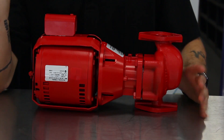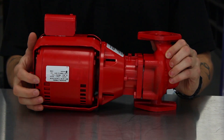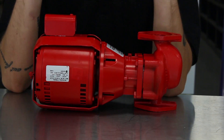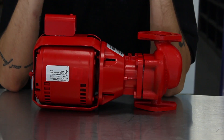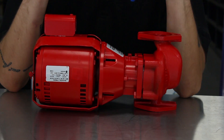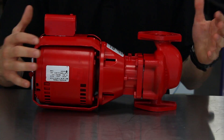Pump tags. Pump tags display all the necessary information to ID a pump. There are commonly two types of tags on the unit: pump tags and motor tags. This is important because the motor model or part number will be different from the pump's model or part number. Pump tags are located on the volute and motor tags on the motor.